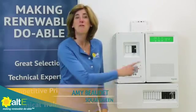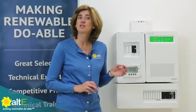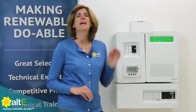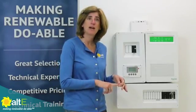We're going to show you a quick overview of the Schneider Conext SW inverter charger. The Conext SW is an inverter charger system from Schneider Electric, formerly Xantrex Inverters. It has a pure sine wave output for a clean AC signal to power your delicate electronics. It can be used as a backup power supply or an off-grid solar power system.